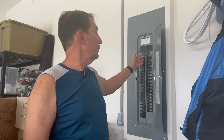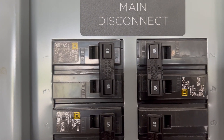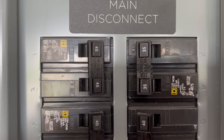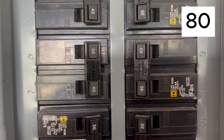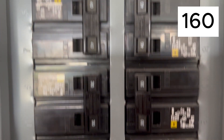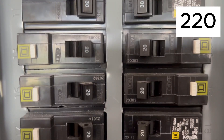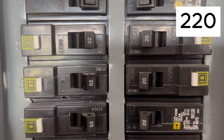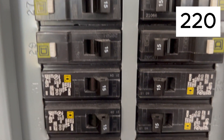Let's take a closer look at this panel board. So you see here, this is a main breaker 200, and then you have some 45, 35 — 80, right? There's 120, just another 80, 160, another 60, 220 — and then you add up all these individual breakers, way over 200.